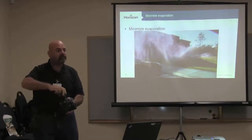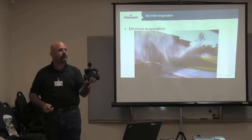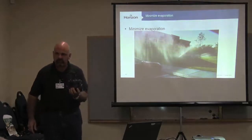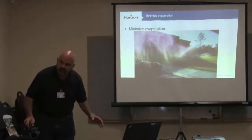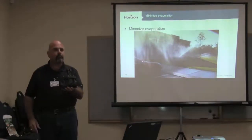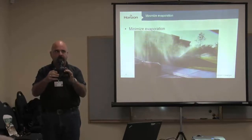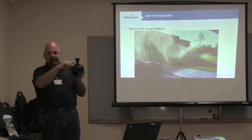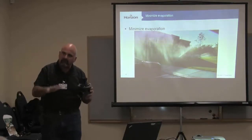When you change velocity, that's fine-tuning that valve. Has everybody fine-tuned every valve out there in the system? Does everybody know how to fine-tune a valve? Simple — no matter what valve it is, if it has a flow control, get in that valve box when the system's running and crank the flow control down until you see that system start to fail. As soon as you see it start to fail, back it off about one and a half turns and let it sit. Your valves will now close at a more even rate, they'll close quicker, and there's almost no way for this valve to stick on. The majority of the time when a valve sticks on, it's because the diaphragm gets shoved up into the top of that bonnet cavity so far that it creates a small vacuum up there and the assist spring isn't strong enough to break that vacuum, and the valve sticks on.